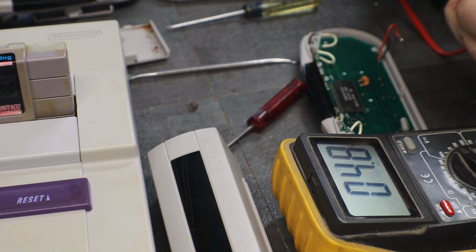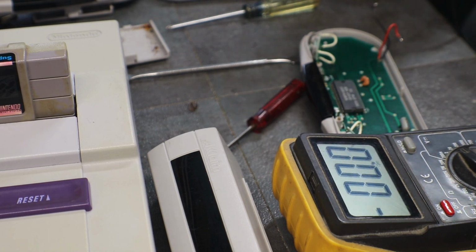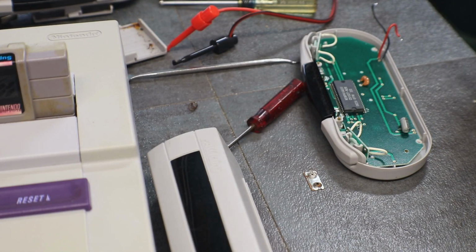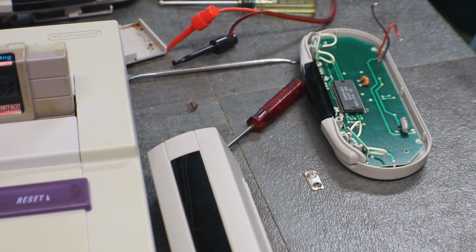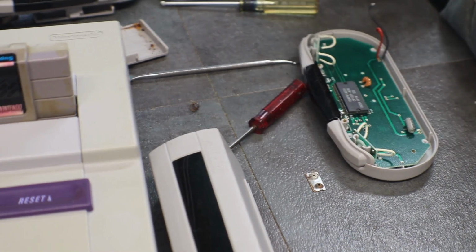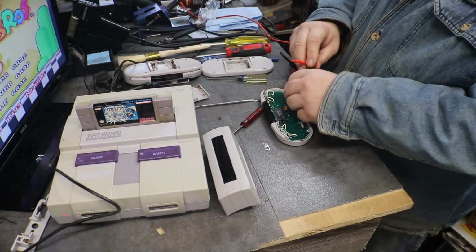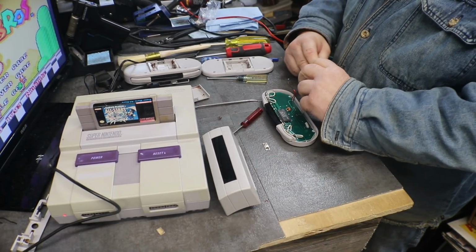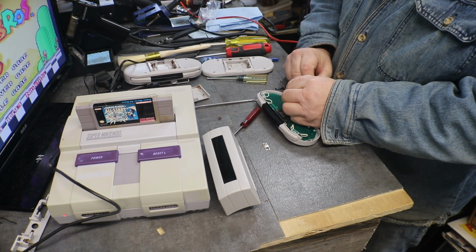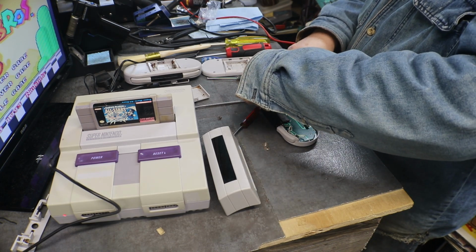Come on. Yeah, see, it's about 5.65, 5.85, 5.9. Yep, about 6 volts coming out of that. 4 AAAs, those are 1.5 volts, but normally you'll get probably 1.7 to 1.8 volts out of them. So I just figured 6 volts would be right if we have some batteries that are a little weak in it.